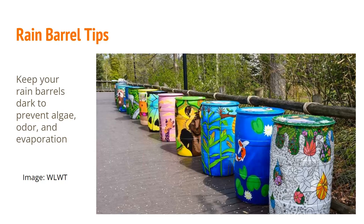If you do that, you're also preventing puddles forming on the ground and getting mosquitoes or mold or, you know, stinky stuff. But if you feel like the area you live in is really rainy, it's going to flood. If you're in a high rain area, you can always point it out to the street if you think that's necessary. But generally in California, I would suggest burying it. Some people attach hoses to the barrel's faucet to do that. You can, so like an actual hose where you would then be able to reach as far as you can. And you've just got a little shutoff valve on that. That's always an option. I used a flexible downspout. Like I said, I liked that robot arm so that I could get it right over the rain barrel where it worked for me.